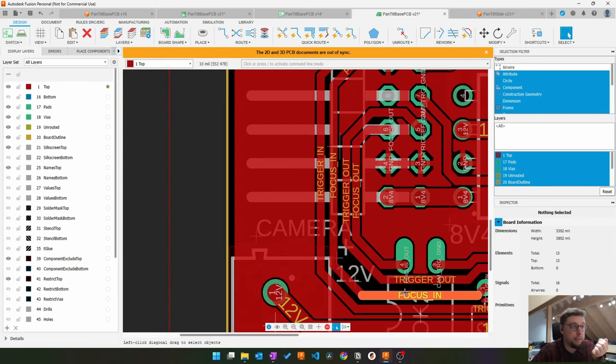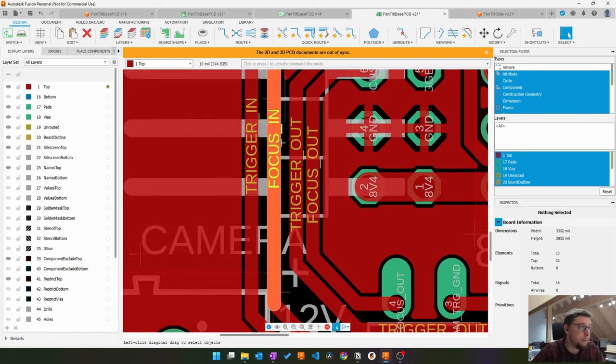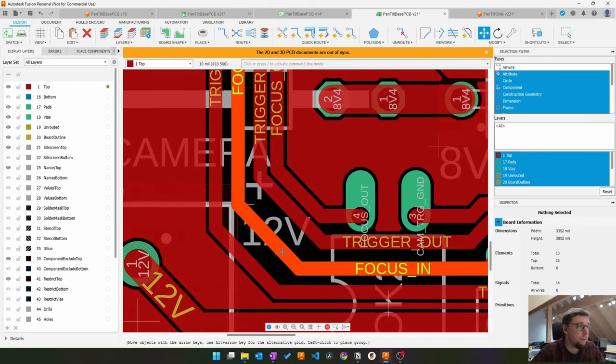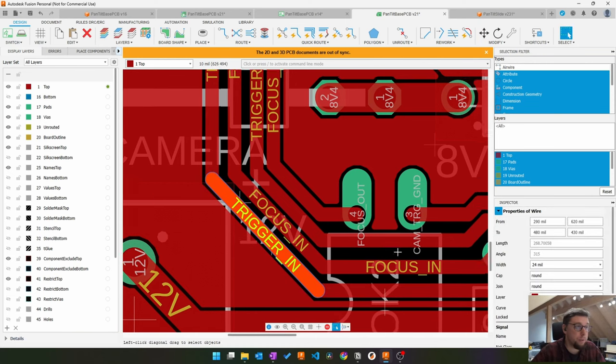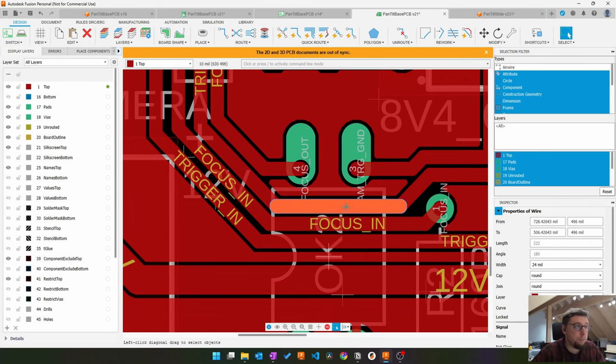ground plane like this. So if you can, you see these signals here. They are all 5-volt logic. They are not in danger here. They are all together. They don't send out a lot of noise. Nothing in here, in fact. So you can keep them together.